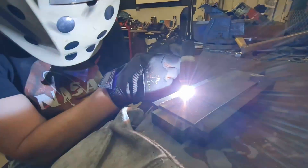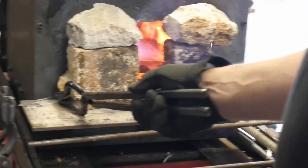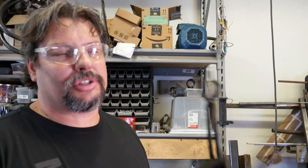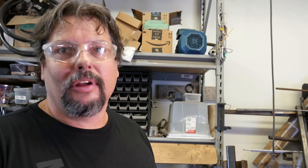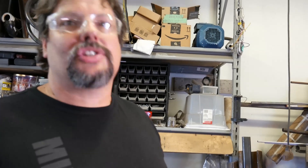Let's add some heat — a whole ton of heat. FORGE FIRE! For setting a forge weld you just want all the heat you can. We're not too worried about the color right now — we just want it to be a bright, almost yellow color. But the most important thing is that we give it time. We get that color but we want it to be that color in the center as well, which takes time. It's called soaking — soaking it in the heat.